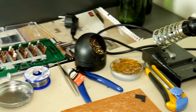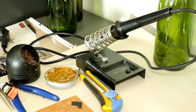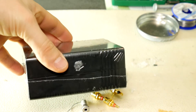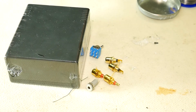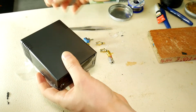As with all do-it-yourself projects, this will require a soldering iron and some tools to make the process easier. From components you need to buy: a plastic box for an electronics project to put everything in — these can be found in construction stores or on Amazon and AliExpress. Links to details will be in the description. You also need four female RCA housing terminals, one 3.5 mm socket suitable for panel mounting, one 6-pin on-on toggle switch, some two-core audio cable, and one short cable with three cores.